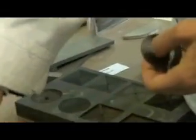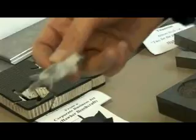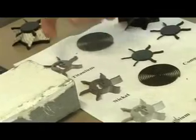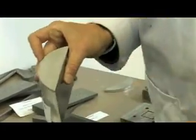I took this home to my dad and he said, 'You're not telling me water did that?' And I said, well in this case water and a bit of abrasive cut that one. So that's aluminium, that's nickel, that's titanium — it doesn't really matter what you're trying to cut. Here we've also got some harder things with titanium carbide and aluminium oxide in them — very difficult to cut — and the water jet just goes straight through them without any problem.